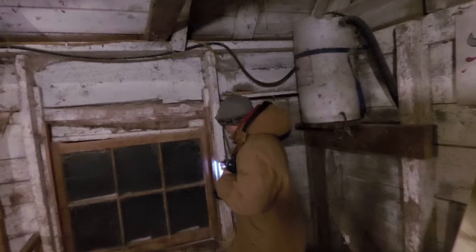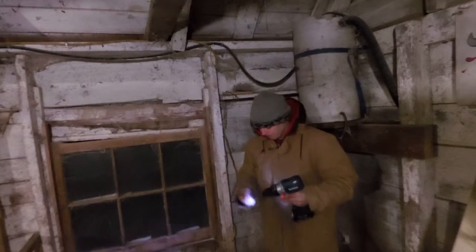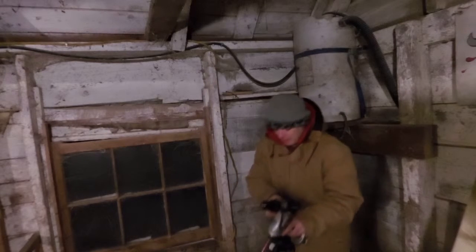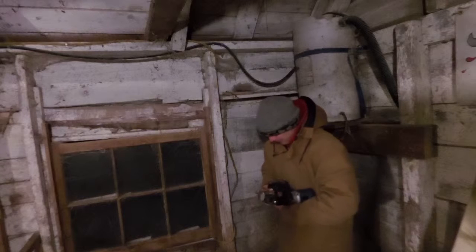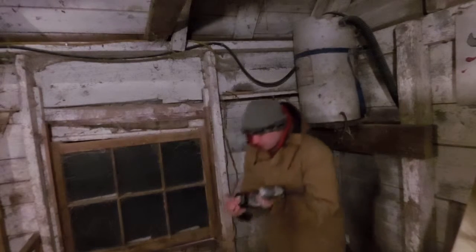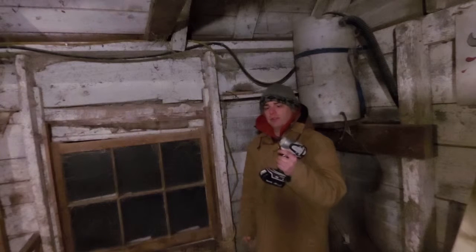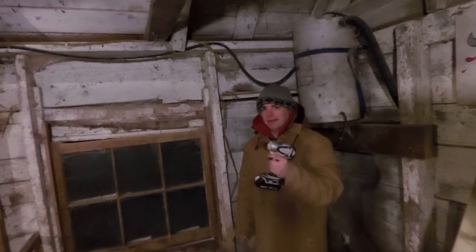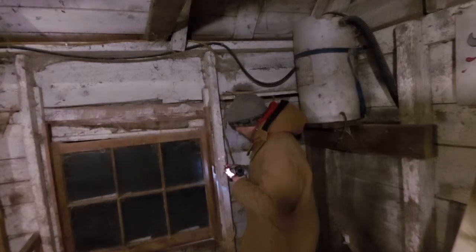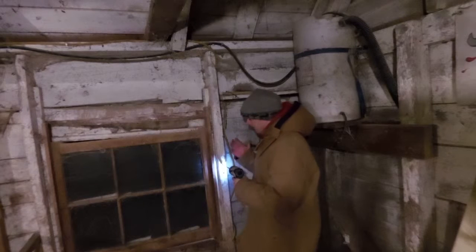I am going to flip this bit and put it on the impact driver and try that. The nice thing about the impact is that for the same amount of pressure it does not skip half as much. That is because it actually taps — every time it taps, in between taps as you put pressure on it, the Robertson end actually pushes itself back into the screw head and allows it to settle, so it does not edge itself out of the hole. We are going to try this with the impact — I am going to do a new hole. You will hear the typical chatter of the impact as it starts hitting once it encounters resistance.